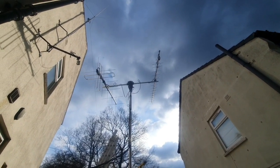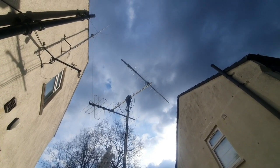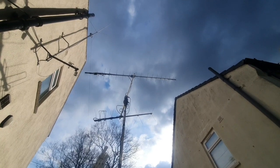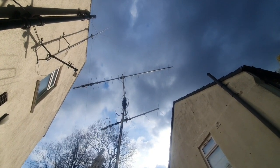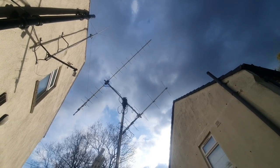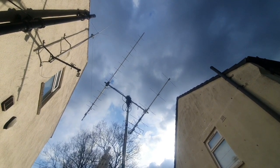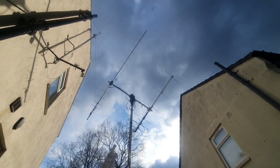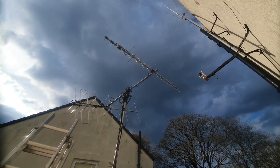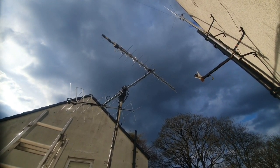We managed to get everything built up and right now we're just positioning for RS44. On the right hand side nearest to us we've got 30 elements of 437 MHz Oscar sat, and on the opposite side we've got 12 elements for 145 MHz — fits in nicely. We've got the potentiometer replaced so we're getting an accurate elevation reading, and the elevation gearbox sounds nice and smooth due to the re-packing of the grease. Looking good as we track the bird!